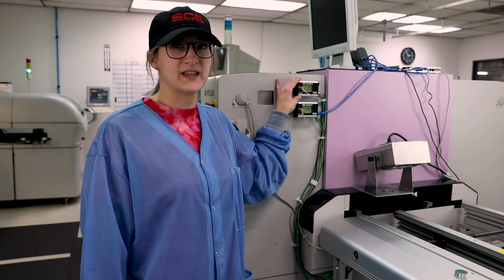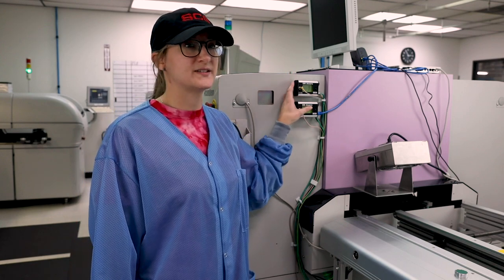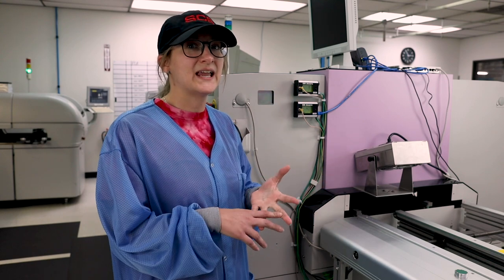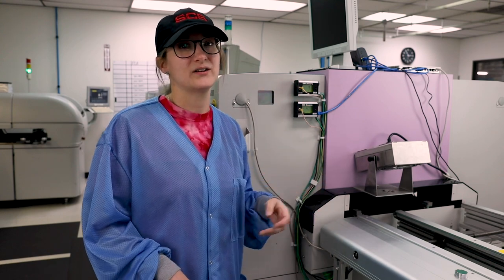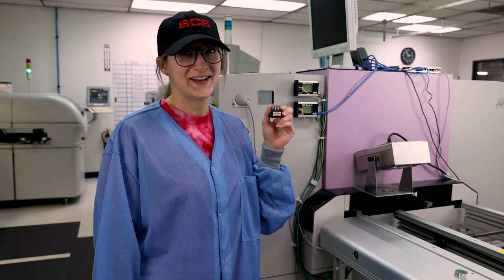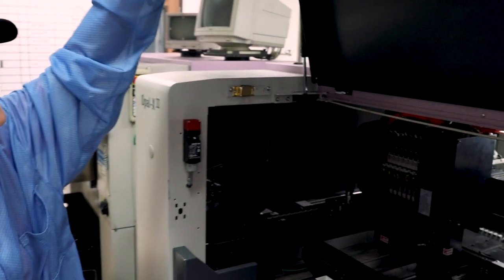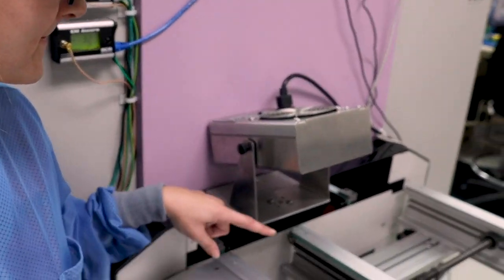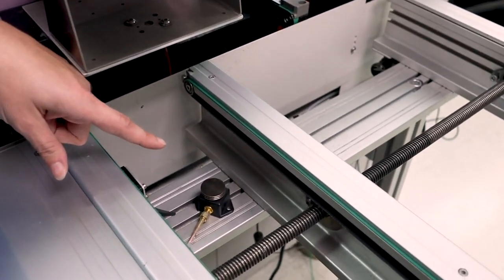There's also these EM-Awares that are set up in your machines to monitor the static voltage and ESD events that are going on. The EM-Aware comes with a really cute antenna that you put where a board might be being populated in your machine, or where there's a lot of movement going on. That's the best way to know.